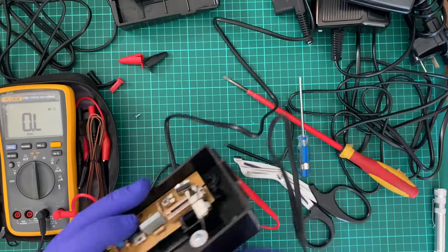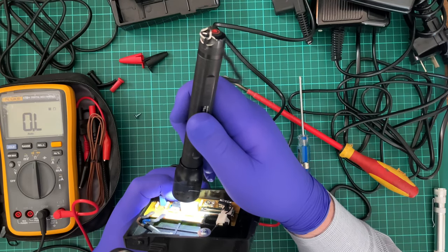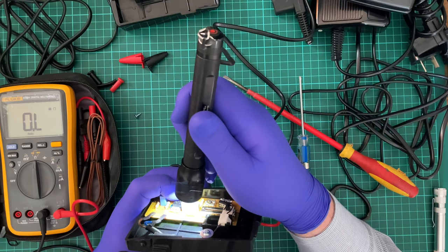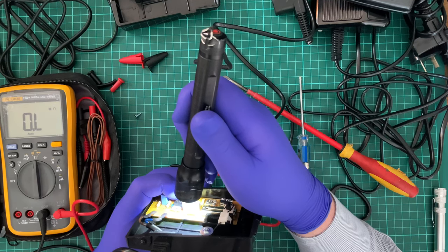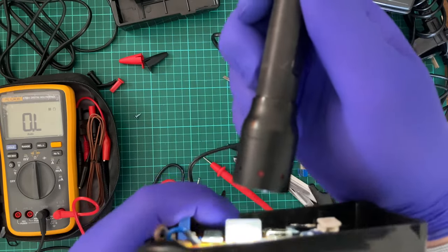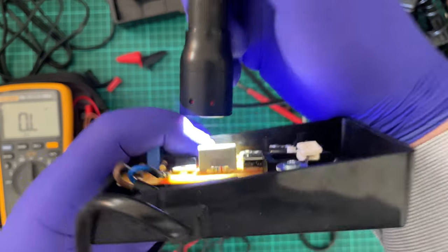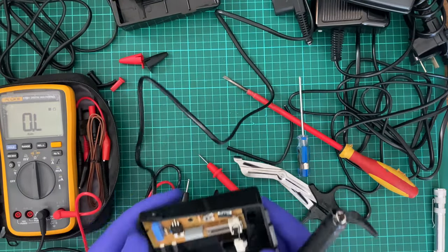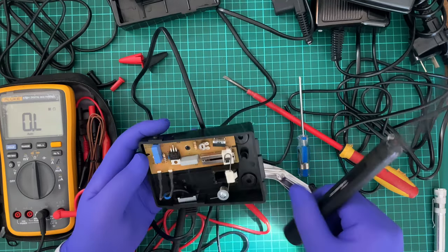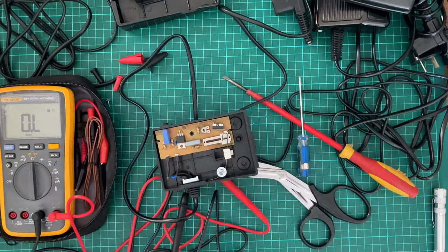Hopefully that was visible. Now this other one, CBB62. It's also a capital X with a lowercase 2, 275 volts, 68 nF. So it looks like it's just a secondary safety capacitor. All right. And a 1 mega ohm, what's that called? 1 mega ohm surface mount resistor.